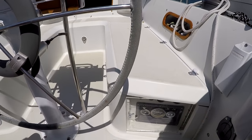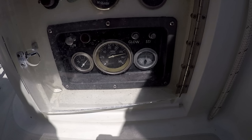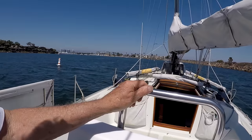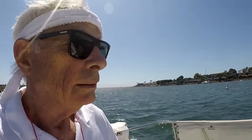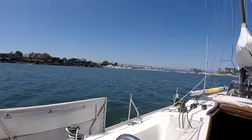Well, here we are. This is almost 7 knots. We're stuck pretty much right at 180 on the temperature gauge after, this must be 45 minutes of test motoring. So it looks like Barnacle Buster worked. After 24 hours sitting time in the hoses. What a day, eh? Well, I think you call this summer.